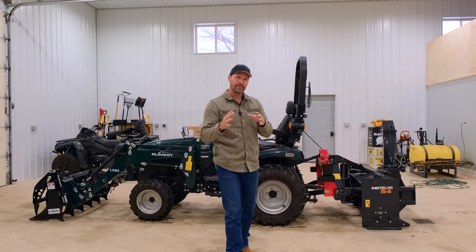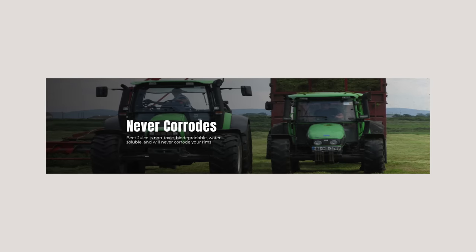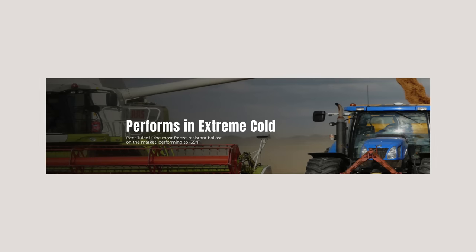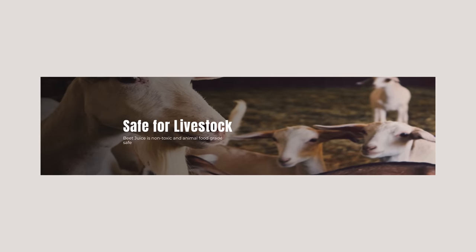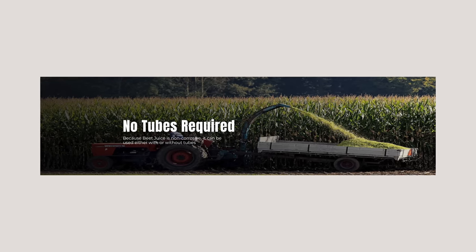And a big part of making sure that it's not corroding the rims is making sure that everything is fully covered, so there's no oxygen getting into the mix down here and having that reaction that starts the corrosion process. That comes into play when something's not filled properly, or if you get a puncture in there and it starts to drain down slowly over time, you don't realize it. Well, if you've been around farming and tractors, somebody will comment in this video how their rims rotted out right around that valve core because of the calcium chloride.